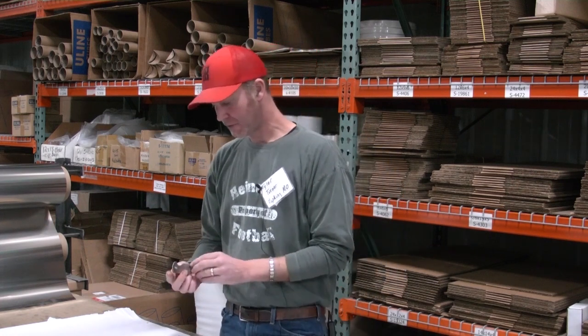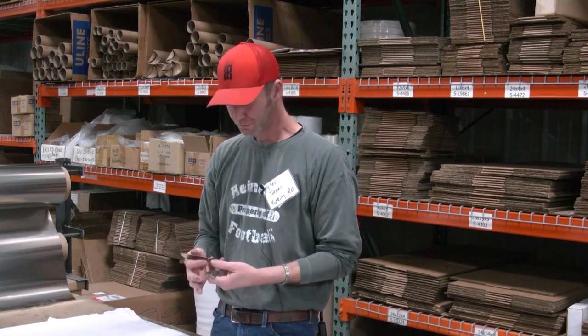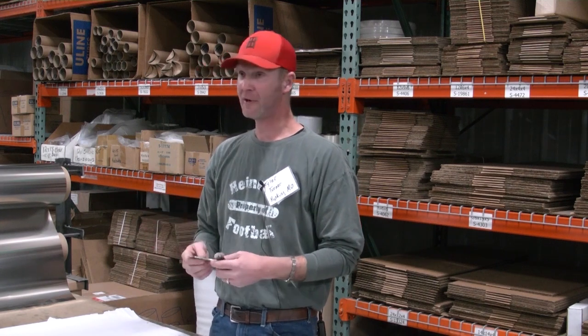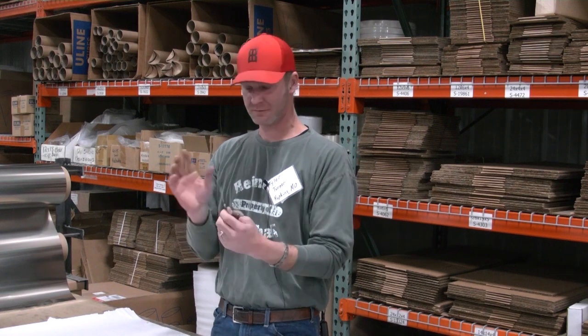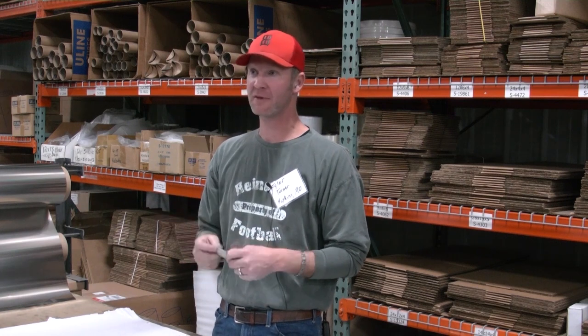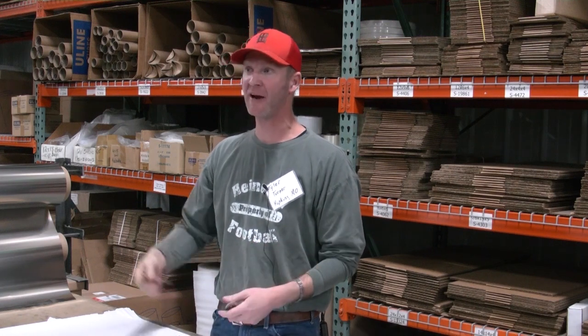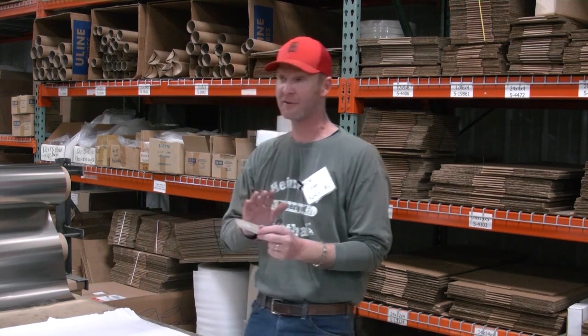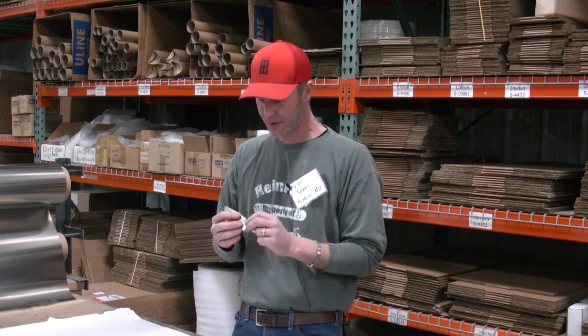So once we have that covered, the blade's cleaned up, open stop locations are cleaned up. I still haven't ground the blade yet. I don't grind the blade till the lockup's done, detent's done, everything, because I found I wasted more time and money when I started. I'd have the blades ground to perfect, plunges perfect, everything. I'd heat treat it, then I'd have to clean it back up. Then if the stars weren't aligned, I'd be fighting the damn blade, and then I'd go and mess up the detent, and I had all them belts, time, everything. So I don't even touch the grind till after the mechanics are done. And it's saved me a lot of time and heartache to boot.